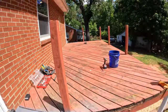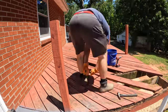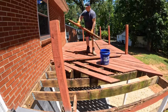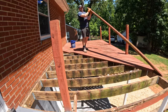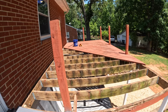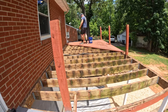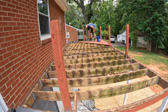As you can tell, that's why I'm doing this project — I didn't like it. It was a little rotted in some places and pretty beat up. Now I'm working on removing the deck boards themselves. These were mostly nailed down with some screws scattered throughout — the nails made it easy, the screws made it hard. The reason I'm going away from the staircase is because my trailer is parked on the other side and I'm throwing all the debris in there. Make sure when you take off your deck boards it's the most convenient way for you, and make sure you have a ladder at the end to help you get down.